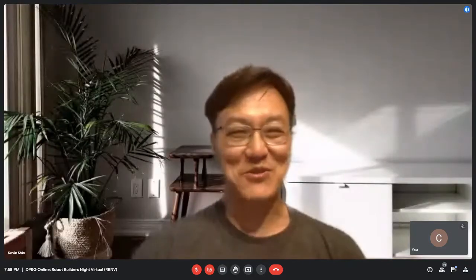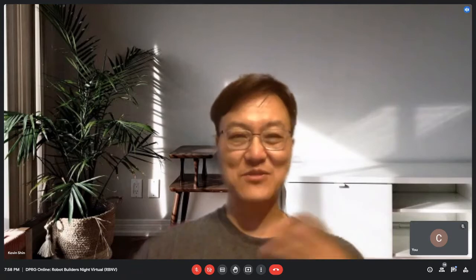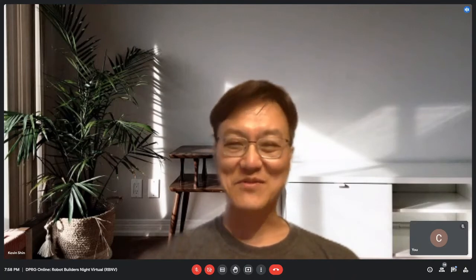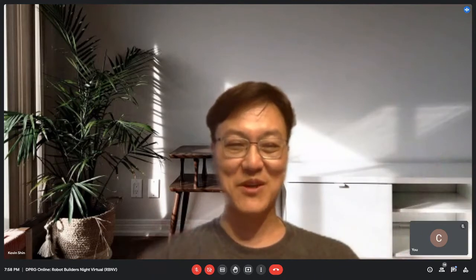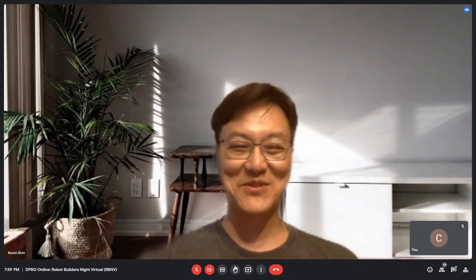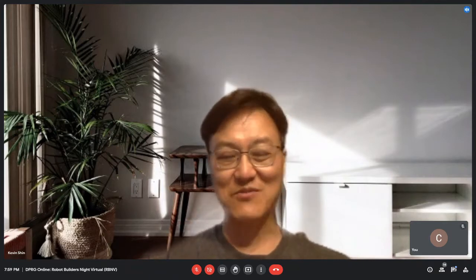One trick I picked up for training your computer vision for picking up color: I used Pixie 2 and experimented with different lighting. What I found out was if you have the picture show up on your monitor where it's backlit, and then train on that, for me that worked awesome compared to trying to find the optimal lighting. So definitely give that a try if you have a hard time finding the cone with the right reflection. Okay, I'll probably be using OpenCV and then trying to train it with the hue and saturation, which is a little more forgiving than an RGB color code.